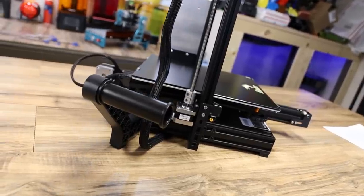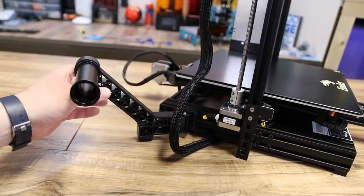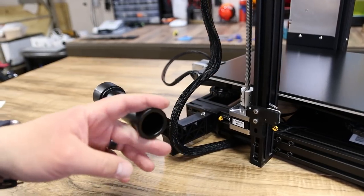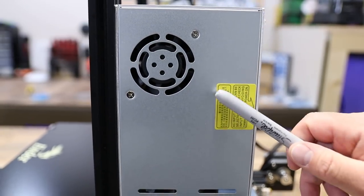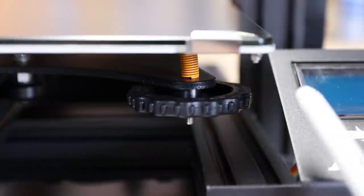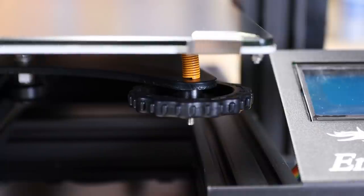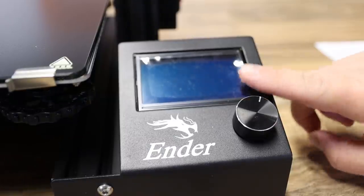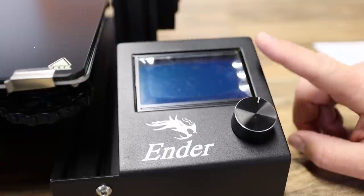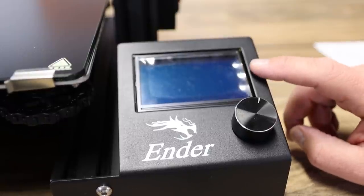One of the things I really loved about the CR6 SE was the spool holder, and Creality sent that same spool holder with the Ender 3 Max. I absolutely love this spool holder — I think these are the ones that should be with all their printers that have side mount spools. It does come with a 350-watt Meanwell power supply, which is great power for this machine. Another great thing is the yellow upgraded springs, which means the springs are going to be stiffer and hold your bed level for longer. In true Ender 3 fashion, it comes with the basic Creality screen. I really like the Ender 3 V2 screen, but this one is good too. It has a lot of functionality, and when you do the firmware update you don't have to upgrade this screen.